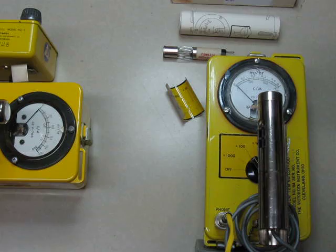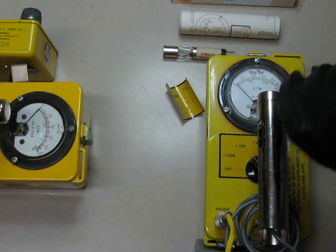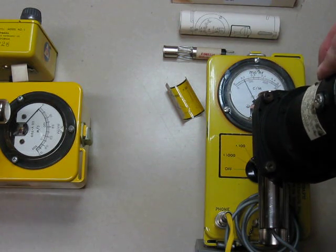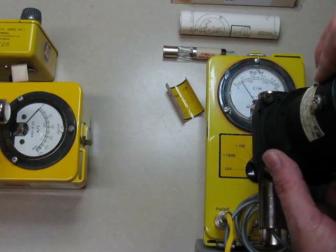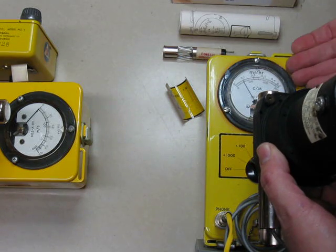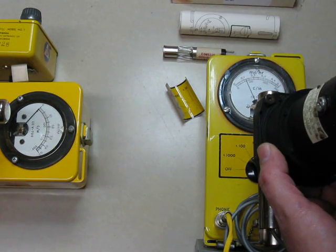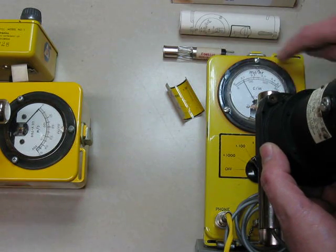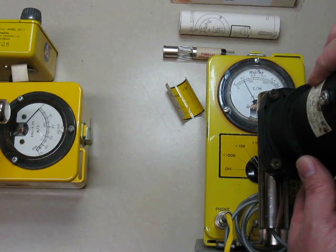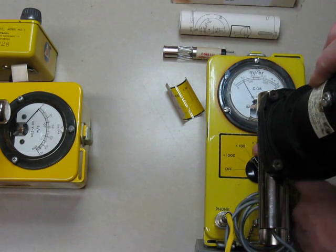I'm going to put that on there, and we'll put the turn and bank on here. Where it was 10 on the x100 scale over on the unconverted unit, you'll see what it reads on x100 here. The clicks are not nearly as high. The CDV-700 is still adjusted to that range of x10, but the tube adjusts for the volume. It's flickering around there, but it's averaging about 10. It depends on where I put it, but it settles in about 10 on x100 on this one.